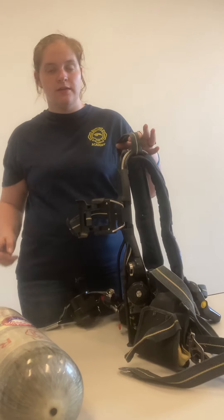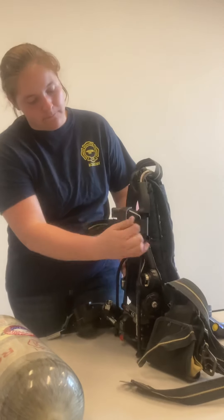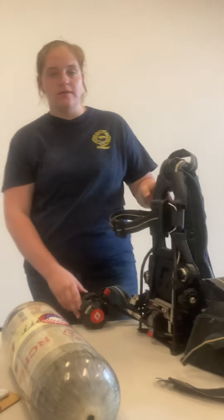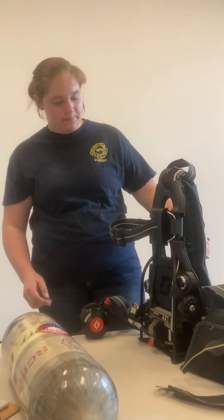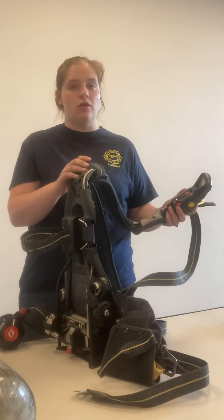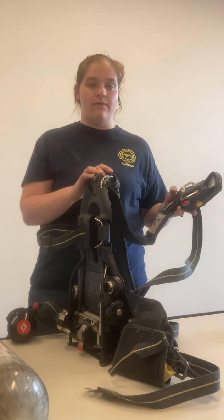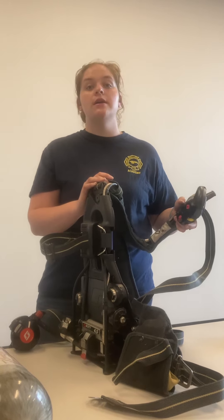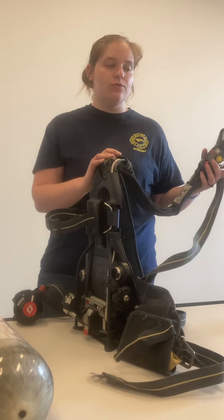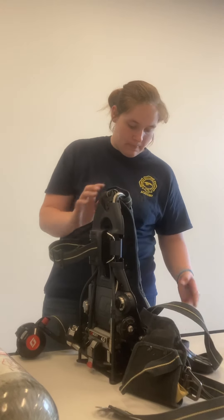Each pack also comes with a drag device to grab and drag a firefighter out. It has a battery port for the integrated PASS system and lights, which flash to indicate alerts and show battery charge by color. The integrated PASS device — your personal alert safety system — will activate if you are motionless for more than 30 seconds. You must move or shake the pack to deactivate it, or you can push the red Mayday button if you're in trouble. To turn it off, shake the pack or press the yellow button; it gets louder the longer it remains active.